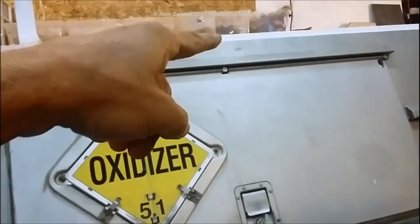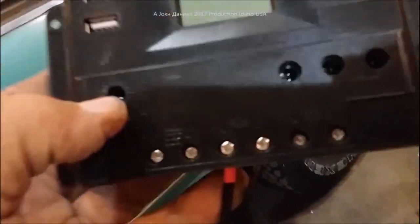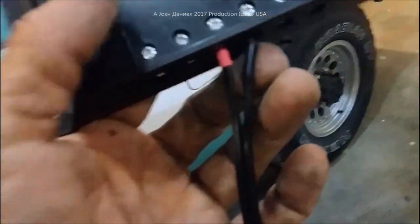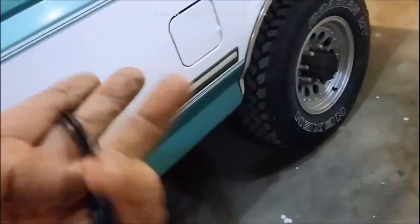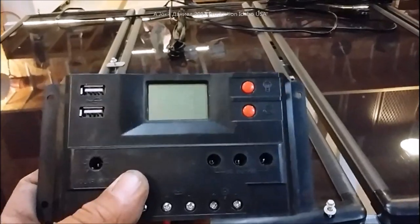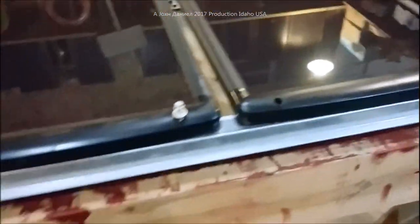These panels will be mounted up on top of the truck and will be feeding the controller. The controller is this model right here — it's 10-amp. You can put the solar in there or wire it direct. It does come with what looks like about 12-gauge cord, very good quality wire. We've already tried this out — I got 91 watts coming through this using a Thermodyne wattmeter, which is pretty accurate, and that was in the evening when the sun was way down on the horizon.